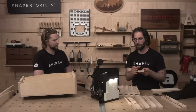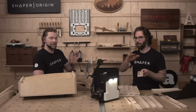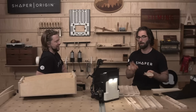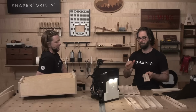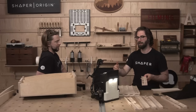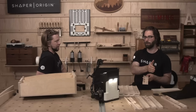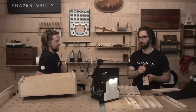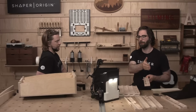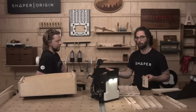So 14 of the 16 angles are 90.6 degrees. Which sounds crazy, but it all comes together. That's what makes this arc. So almost all of these are at 90.6 degrees. There's two exceptions. The far right side of the cabinet is a flat 90 degrees because that's the 90 degree corner of the cabinet. The opposite side of the door is, I think, 82 degrees, because that's the farthest in on the curve of the cabinet, and that transitions to the other flat side of the cabinet, so it's a sharper angle.